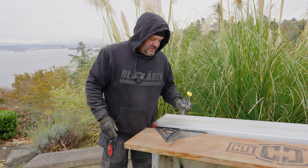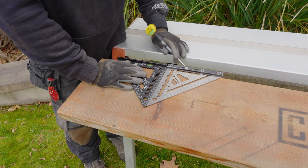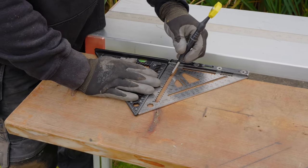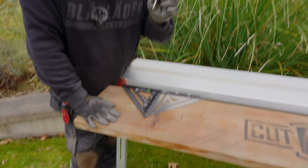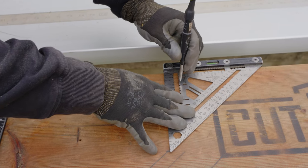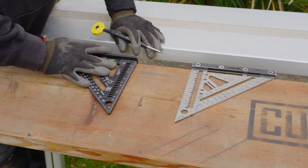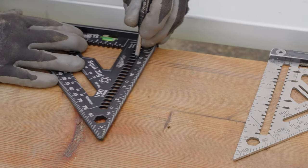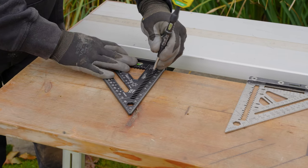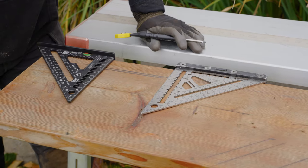One of the best features is being able to draw straight lines across lumber. On the Martinez, I personally use this section the most. If I need to do an inch-and-a-half line with a Pica pencil, it sits in the groove and I can mark it. I can also go to inch-and-three-eighths or inch-and-a-quarter. On the Squid Jig, it has quarter-inch markings, so I can do an inch-and-a-half or inch-and-three-quarters, but for an inch-and-five I won't be able to get that line the way I can on the Martinez. That might be a deal breaker for some — not for me.